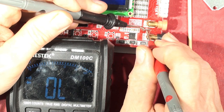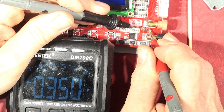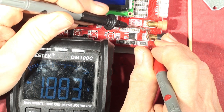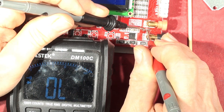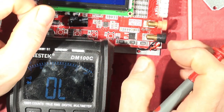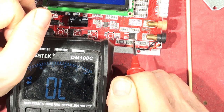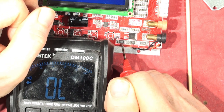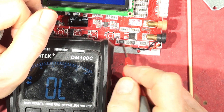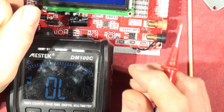What about the other device on the back — is that gone too? That looks like someone's done some soldering on it recently. It's probably not blown — not shorted. It might be open circuit but it seems all right so I'll leave that. So we need a 1210 or 2512 resistor — 0.1 ohm. I'll go and fetch some 0.1 ohm resistors and find a suitable FET to go in there.